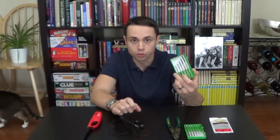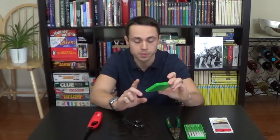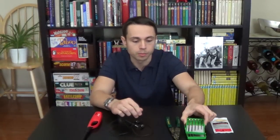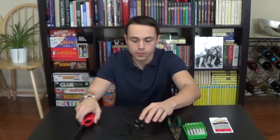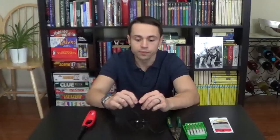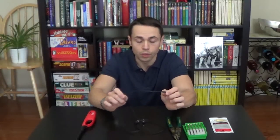What you're going to need today to do the project would be a pair of jeweler's screwdrivers, specifically the Phillips screwdriver set. I got these at the Dollar Tree for about a dollar — you can easily find these at any department store. A pair of wire strippers, a lighter to burn off the enamel like I showed in my other videos, and of course the broken set of headphones. You know there's a short in the wire if at the plug you bend it back and forth and the sound goes in and out.